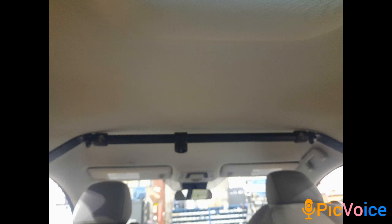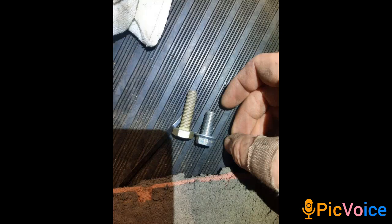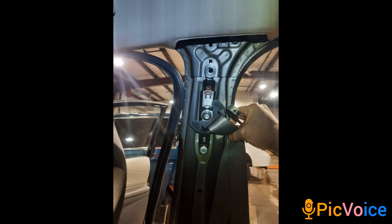Here's a video on how I made an overhead handrail system for a customer to transfer from the center position in their manual chair into a driver's seat. I used quarter inch steel for the side plates, schedule 40 piping for the handrail itself, and longer bolts to go through the seat belt so that we still have the full thread.